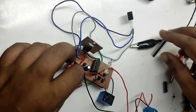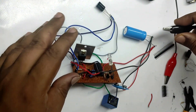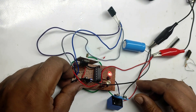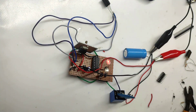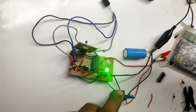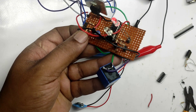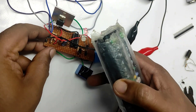Now it's testing time. We are connecting the 12V adapter to the circuit, connecting the power supply across the filtering capacitor — that will be quite easy for us to connect the alligator clip. You can see the red LED is lighting, which means the relay is off. I will use my television remote control for switching on and off. You can see the green LED is lighting, which means the relay is on. I will bring the relay and circuit close to the mic — listen carefully for the tick tick sound of the relay. Our circuit is working perfectly.